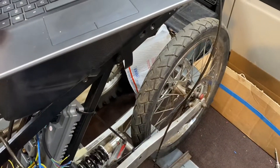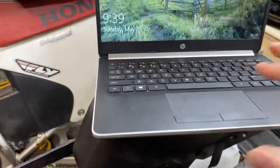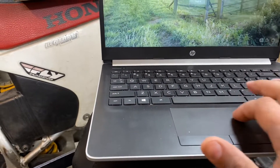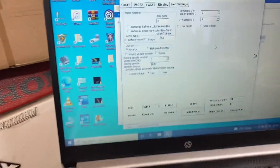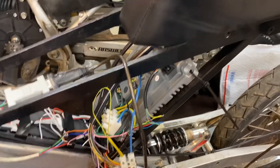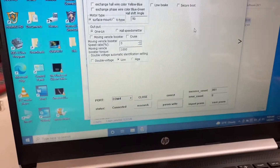It starts going crazy, and even if you go into the settings it's the same thing. Sorry for the noise — I have my giant lab computer over here with 120mm fans spinning in my face. I forgot to shut it off. Going into the settings: I have three pole pairs set, since this motor only has six magnets, so that's correct.